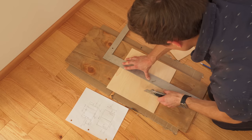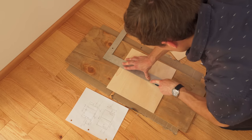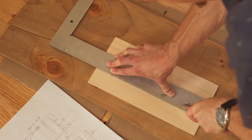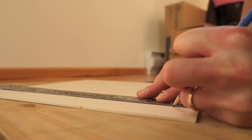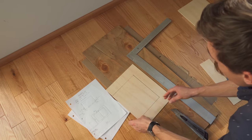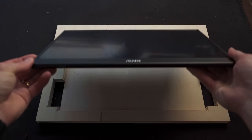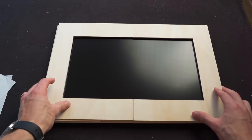With my plans done — twice — I moved onto the cutting. I grabbed some cardboard and a scrap piece of plywood so that I wouldn't cut into my floor, and started measuring and cutting. Just a tip here: when lining up and cutting on your mark, err on the side of making your opening for the monitor bigger. It's alright if the opening is a little bigger than the monitor because we'll be using some foam tape to keep the monitor in place. It's better to have the opening be too big than too small. I would recommend cutting the front and back pieces last once you've had some practice with the inside pieces — the front and back pieces are the only ones that'll be seen in the end, so they're the only ones that need to look nice. After finally finishing all the cutting, I put the pieces together and discovered the next issue: when you make a bunch of imprecise cuts by hand, they are imprecise. So everything didn't quite line up. Don't worry though, we'll fix this later. As long as the monitor fits inside, you can press on.